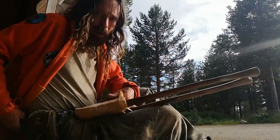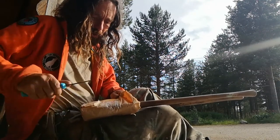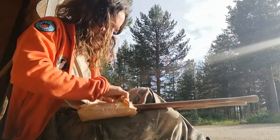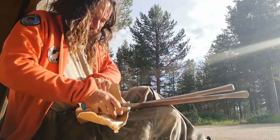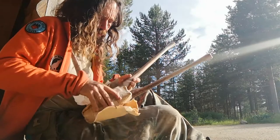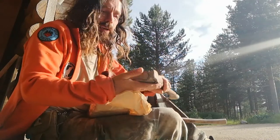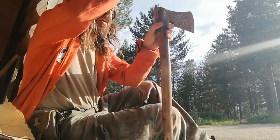With these old axes, the handles can quite often be a bit loose. You can solve this by soaking them in linseed oil, and if this doesn't work I'll explain a bit better once we've got the package open. That's very loose — the wedge is coming out. To tighten them up, quite often all you need to do is bang the head down and then knock the wedge in.